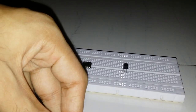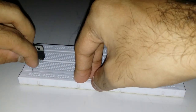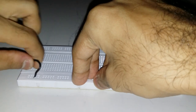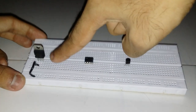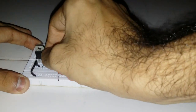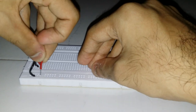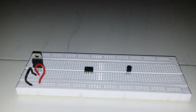So let's start our connection with IC7805. Pin number 2 of IC7805 has to be grounded — let's ground it to the ground rail. The third pin will go to the VCC; let's plug the third pin into the VCC. The first pin will be connected in the later part of the video.